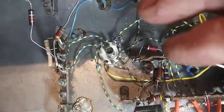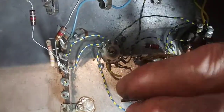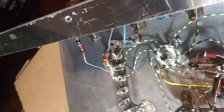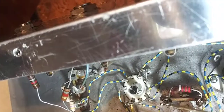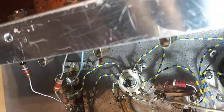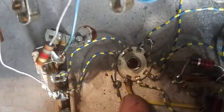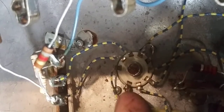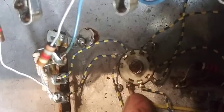So I see this heater wire — it's not even soldered in. The 12AX7, right here, look at that. Looks like he forgot to solder it. It's bent up nice, got warmed up though. It might have shrunk up and that might be why it was crapping out.